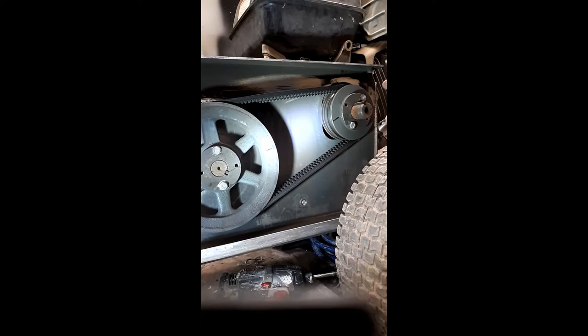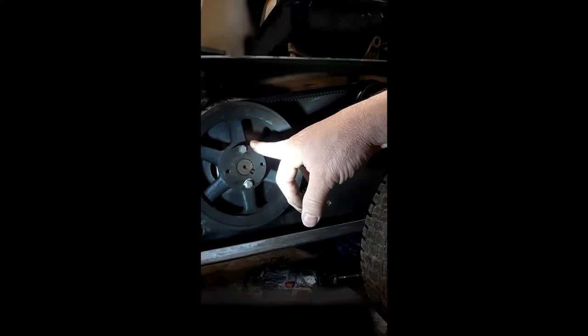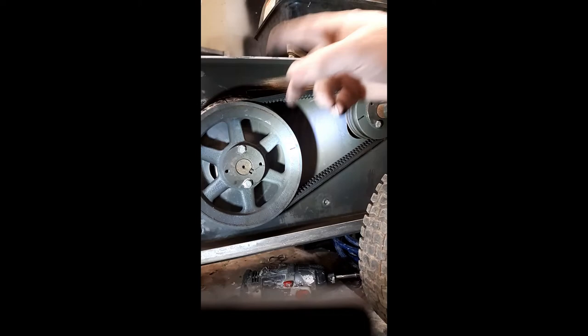So what does that mean? When the engine is running at full throttle — 3,500 RPM — the pump does two engine turns for one complete revolution. That means you're getting half the RPMs on your pump. But your pump is still producing 4,000 PSI and three and a half gallons per minute — the same as a direct drive — except the pump is running at half speed.